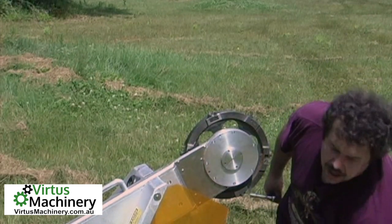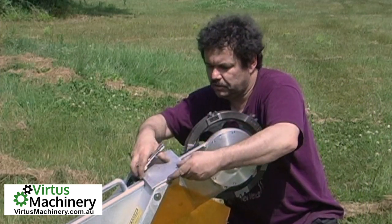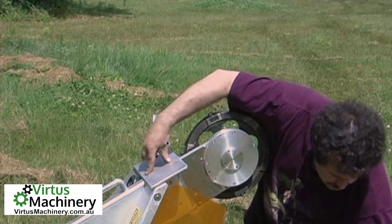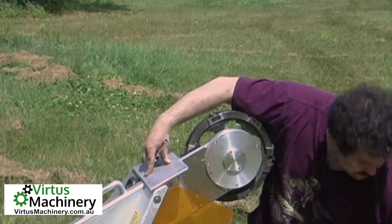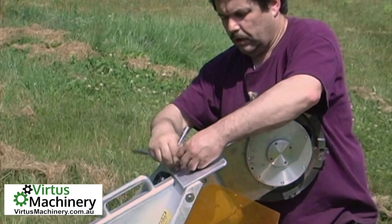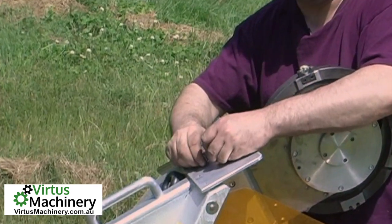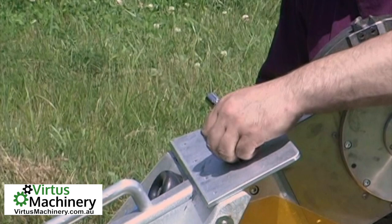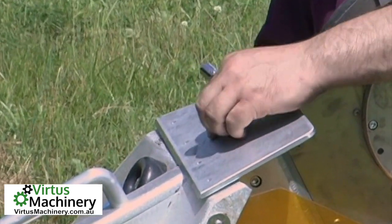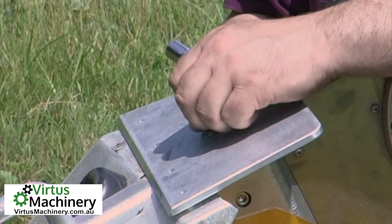And now we're going to put on the top plate. It allows us to get 12 inches deep into the ground, and it also gives us a lot more visibility when we're doing stump grinding, or let's say we've got to trace out some roots to root prune. You get tremendous visibility. Now, the only thing I caution everybody about is it will throw rocks about 50 feet out in front of the machine.